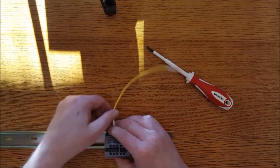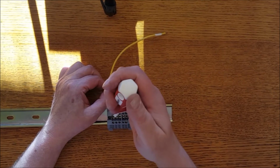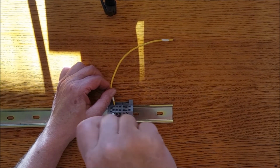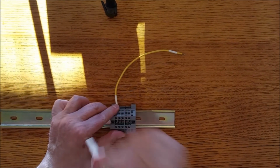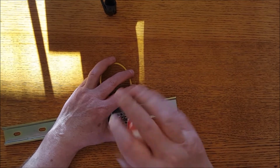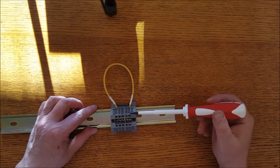This is one of the jumper wires like you'll be using for your lab projects. They're located in the PVC tubes on the back of the chassis. They all have a unique number, and they're also tinned with solder on the end, and that kind of helps since they're used so often, and they won't get frayed as bad, and you can reuse them over and over a little neater. But when you mount them on the terminal strip, you put it in, tighten it, and you feel it snug down, and at the end you give it a little tug, make sure you've got a good bite and it's not going to fall out.